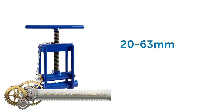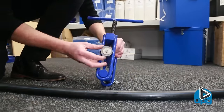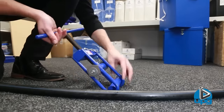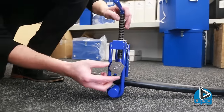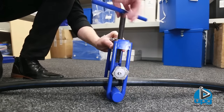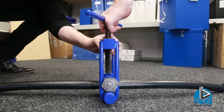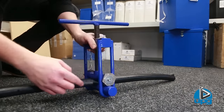The UPG Pipe System's heavy-duty squeeze-off tool is your essential companion for managing flow in plastic pipes ranging from 20–63mm in diameter. Constructed from durable steel with a unique double-loop design, it ensures longevity and efficiency. Its key feature is rotating buffer stop plates that guarantee no damage to your pipes. Whether aiming for a temporary pipe closure during repairs, controlling fluid or gas flow, or isolating sections for testing, simply wrap it around the pipe section and tighten its screws.